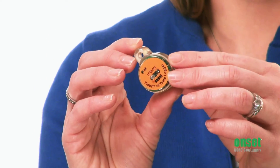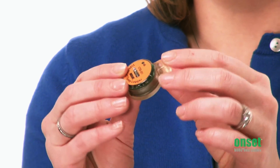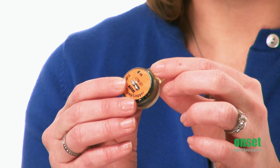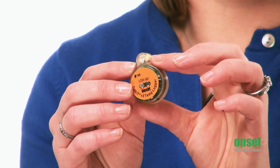Finally, and arguably our most popular water temperature data logger, we have the Tidbit. The Tidbit is our smallest size water temperature logger and is very durable and fully encased in epoxy. This logger is waterproof up to 300 meters and gives you a bit more range than the U22, but the same accuracy with 0.2 degrees C on the accuracy spec. This logger is ideally suited for applications that require a sturdy deployment, including times when customers will mount these to rocks using cement. This is our most popular water temperature data logger.